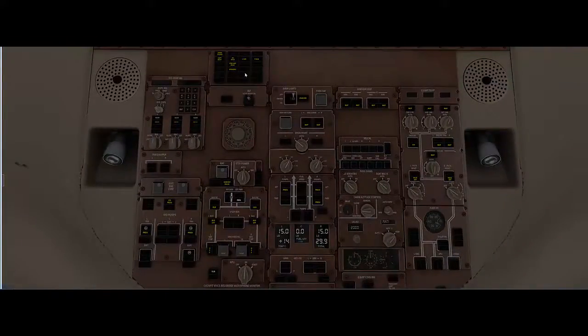Coming to the next panel, we need to go down. So this is down the second overhead panel. Make sure all these lights are on. The emergency door light, etc. The evac control panel. Push to test the evac light. It's armed. Yep. Moving down to the battery panel, we know that we've got batteries on, and standby power is at auto. That's good. Okay.